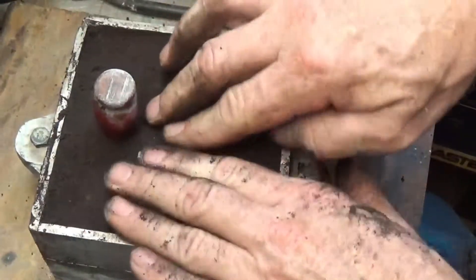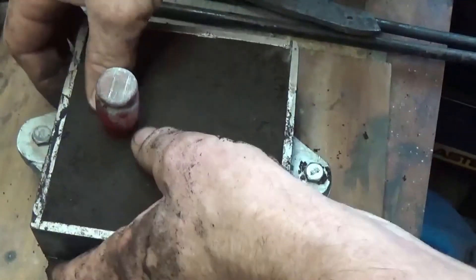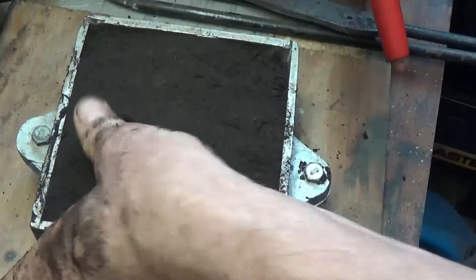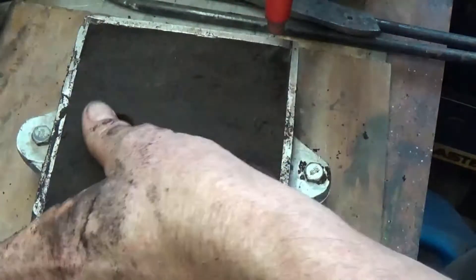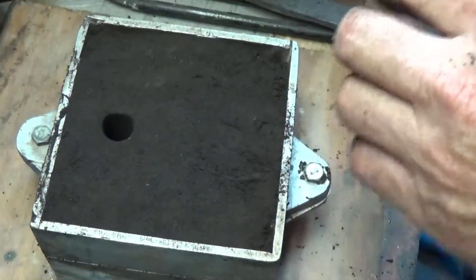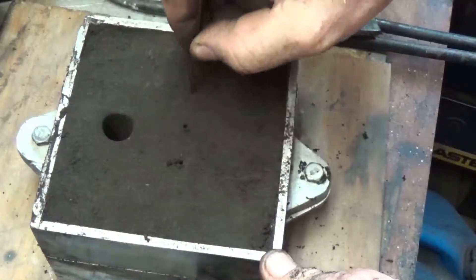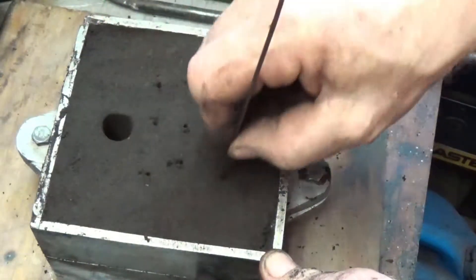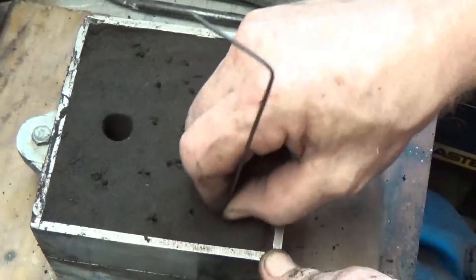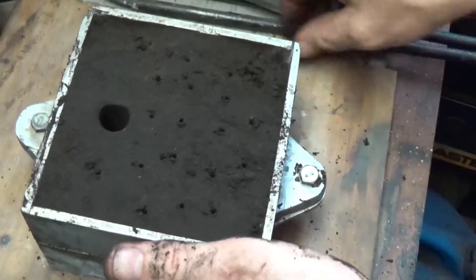So there's the finished rammed cope and drag, or flask. I'm going to pinch the sprue in a little bit and rotate it — I want that top to be a little bigger to make sure none of the sand falls in during my pour. Next thing I want to do is vent this. I'll get to about the depth of the top of the flask and put holes in here using a steel coat hanger. There are a lot of gases trapped in here — gases create bubbles, bubbles create voids, and voids put porosity into your casting, which we don't want.